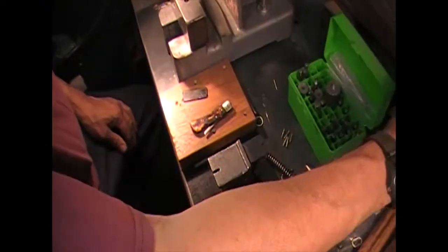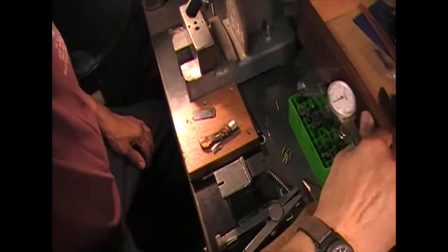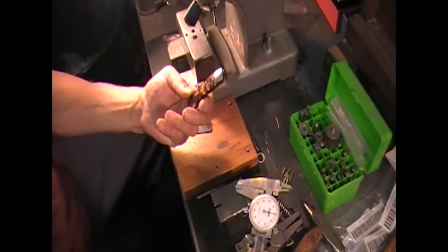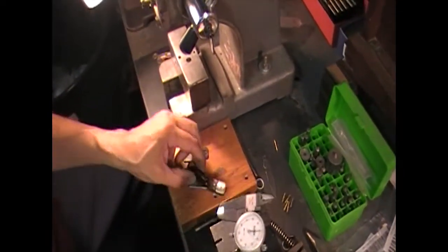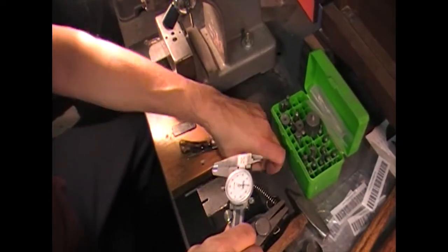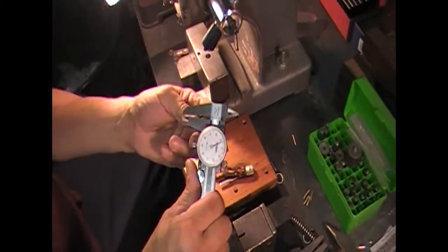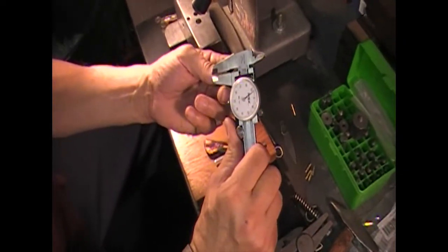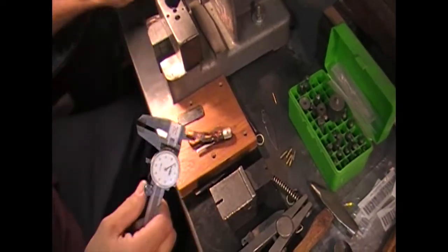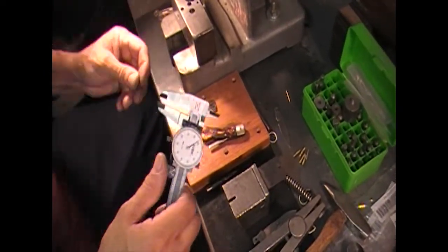Now the pin's out. Another piece of equipment that everybody should have is a set of dial calipers. I know because I work on this pattern a lot that that's a 14 gauge piece of wire. This brass wire right here is not 14 gauge — it's 13 gauge. That's 0.093 to 0.094, which is 13 gauge. So 14 gauge would be like 0.083 to 0.082.